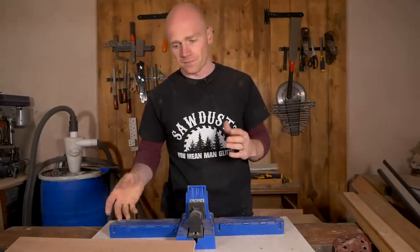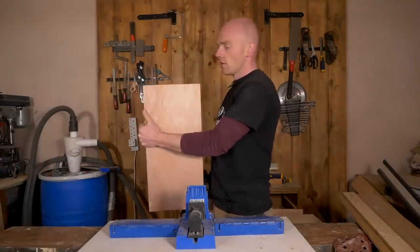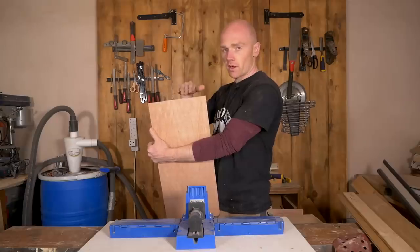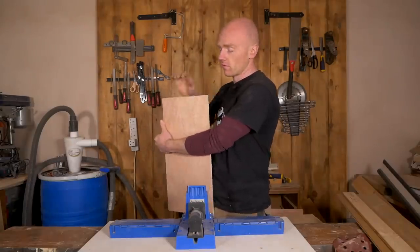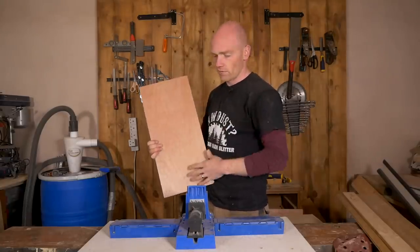If you are building a cabinet where the end panel is visible, then you really want your fixings to be all from the top, or you could do biscuit joints or some other hidden joinery. Pocket holes you can use on the top section and the bottom, screwing in sideways into these pieces. So it means your end side panel is completely free of any fixings.